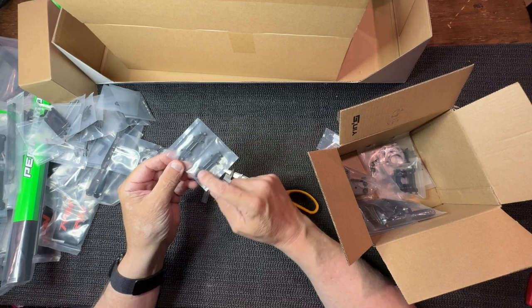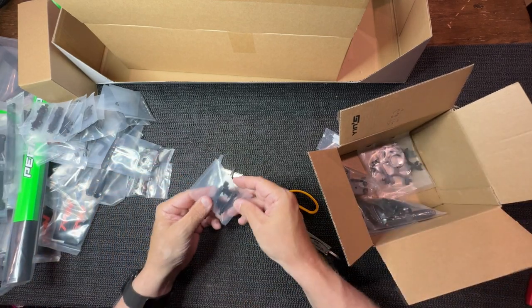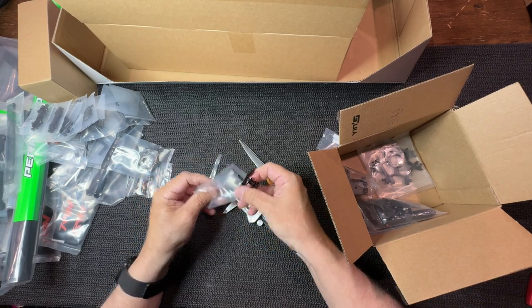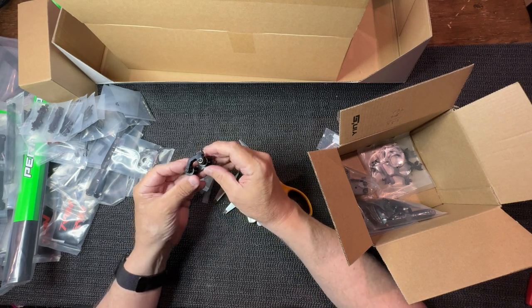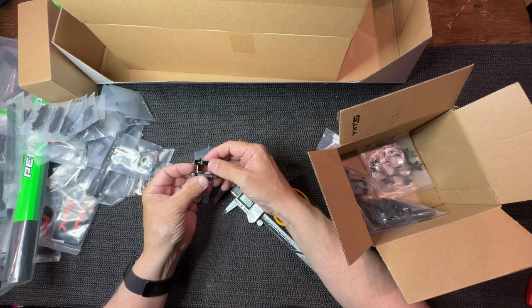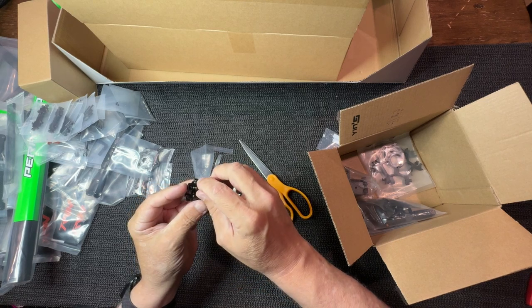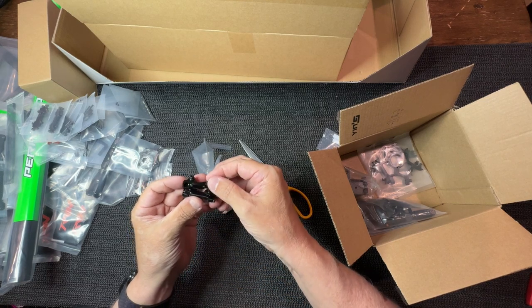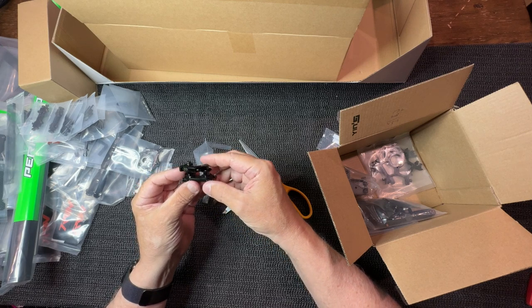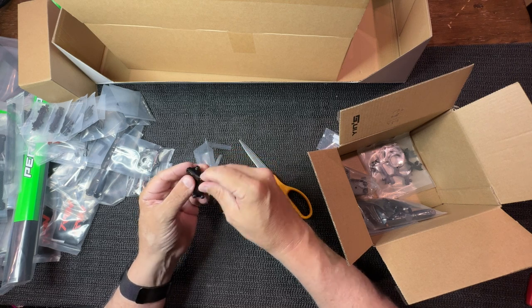This is the landing gear box, and these are the frame spacers with holes for the carbon cross members. They also came with automatic tensioners. You have a spring and a set screw - you put it in the heli, apply more pressure and the spring comes out and applies more pressure. A very simple but very effective way to have constant tension on the belt because it's spring-loaded and you can adjust the tension. This comes now standard.